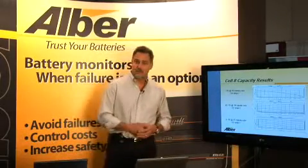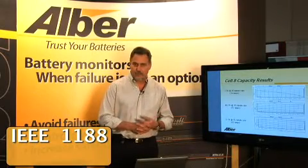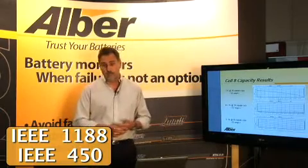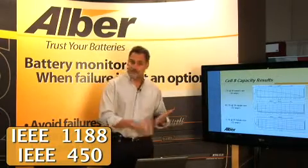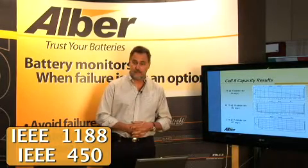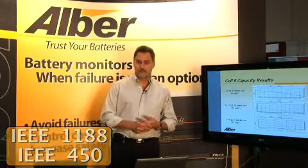The system is capable of monitoring and doing the IEEE standard test using the IEEE 1188 or 450 and allows you to do the acceptance test or the performance test or service test for 1188, or you can also do the modified performance test for the 450.